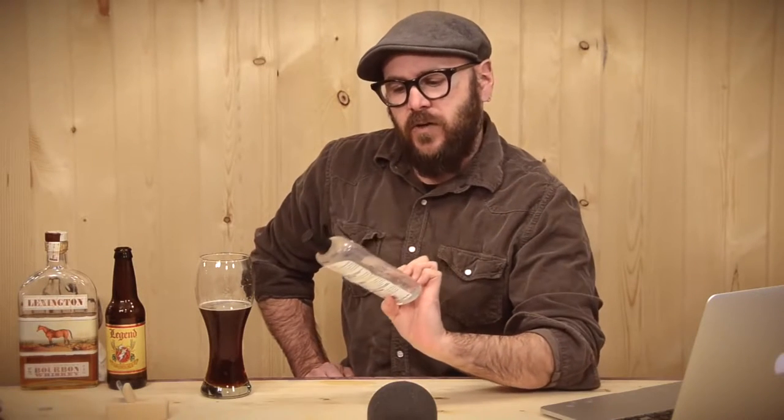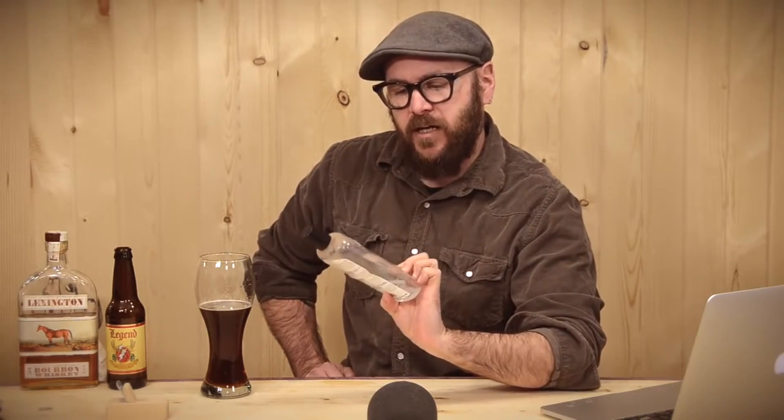Well, let's start with cutting board. You are going to want butcher's block oil. I use this for the cutting boards that I make. You gotta oil them back up every so many months. It depends on the usage. You'll see when the wood starts to get dry. This is called Howard Butcher Block and Cutting Board Oil. You don't want to buy that. Take some mineral oil. Coat it with some mineral oil. That'll work as well. You want to add a little bit more protection. Melt some paraffin wax into that mineral oil and then coat the cutting board with that.